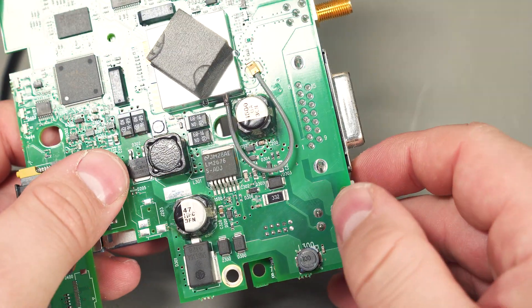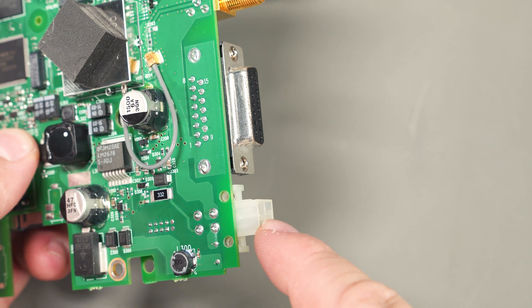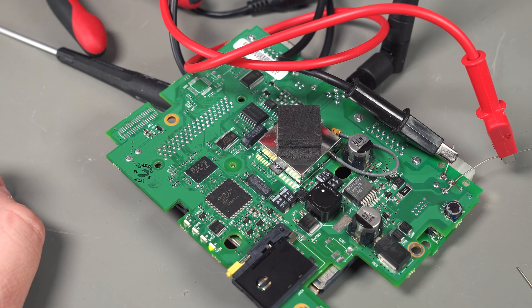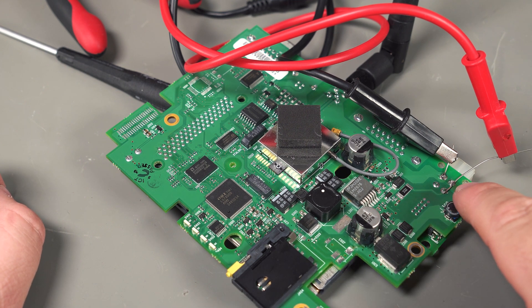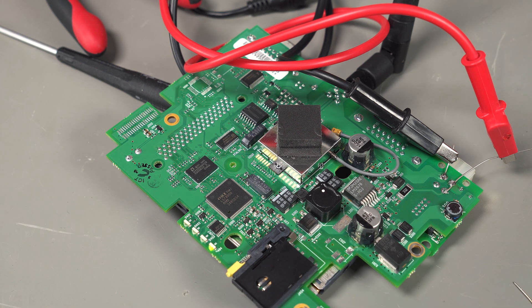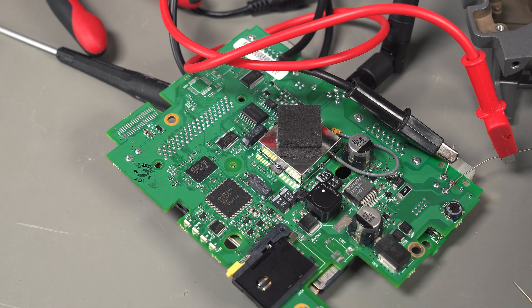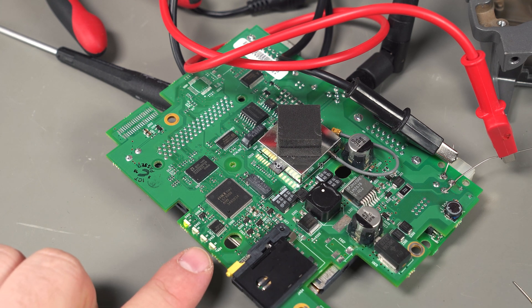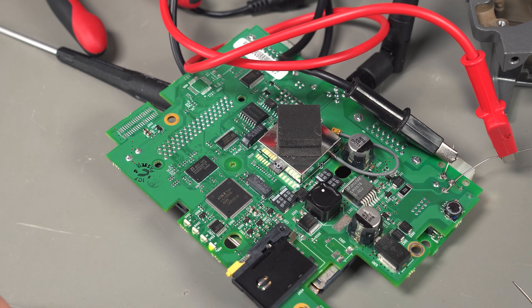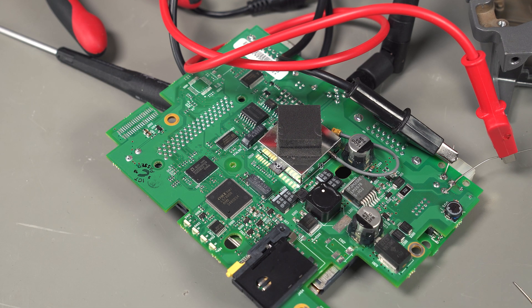I'll probably have to solder on some leads to this. I did determine that this is the same connector as a 4-pin EPS power connector, but I don't want to chop one up right now, so let me just solder something to this. It's not drawing much power, but I did figure out that you need to bridge these two pins, otherwise it won't power on — this must be a voltage sense pin. The power LED is flashing and it's occasionally flickering the GPS lock LED. I have a little GPS antenna hooked up, and I'll try a bigger antenna. If this works as just a GPS unit outputting standard GPS data, I could use that as a time reference for my pfSense router. It's only pulling 86 milliamps, so it's not drawing much power.